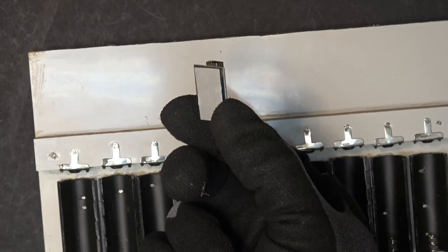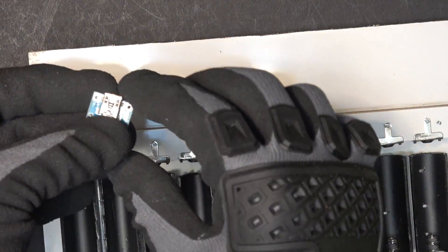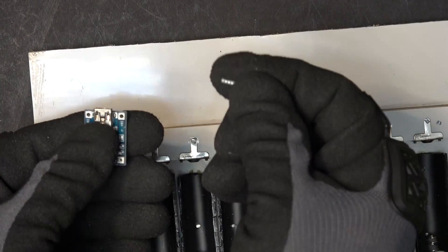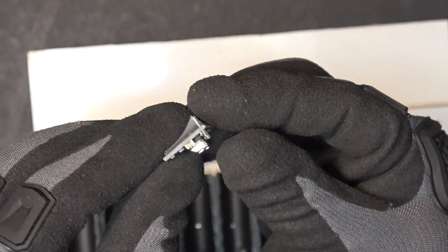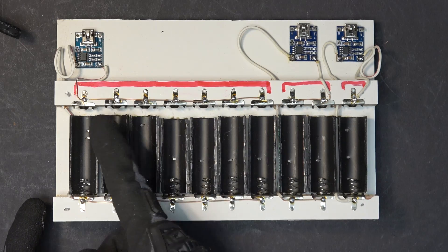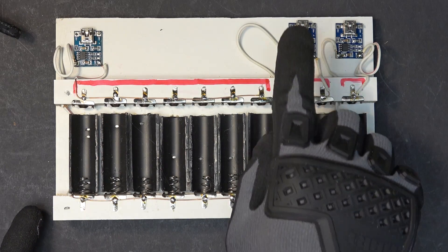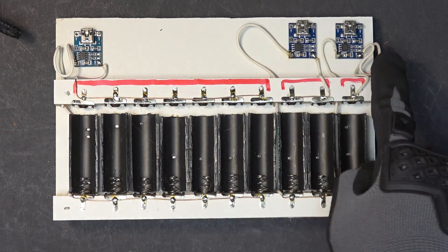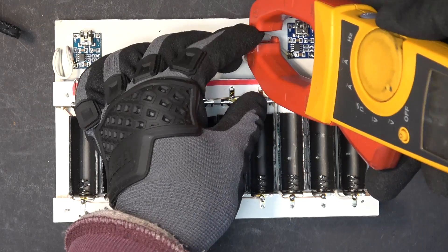Next step is to install the TP4056 board onto the plywood. I'm going to use double sided tape on the bottom to stick it on, and then to secure it I'm going to use brass nail again — this brass nail fits perfectly through the hole. I have it completed. I have seven of these connected in parallel going to this TP4056 board, two of these in parallel going to this board, and this is a single going to this board. I have excess wire here, here, and here so I can use my amp meter and loop around the wire to measure the current when I need to.